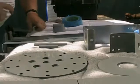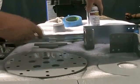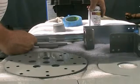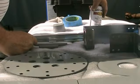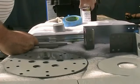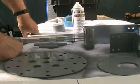You don't want to paint the bolts because the bolts make ground, just like it makes a ground in here. Now I'll have to take a rag and wipe that overspray out of there, but the ground is made through here and here on a 2-wire system to your pole. It's also grounding for the 3-wire system so that you can actually lightning ground it. You can connect it to a lightning rod. And that should just about cover the right way of painting your PMA mounting brackets.